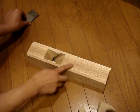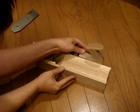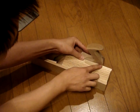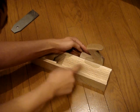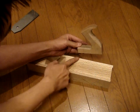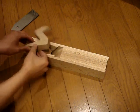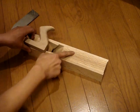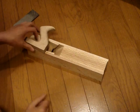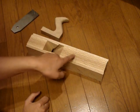So try to keep it in a middle-ish area. When marking out, I placed the iron and my tote and kept moving back and forth until I found a good spot. I marked the back end, scribed a straight line across, measured the length of the tenon, scribed another line across, then measured the width and basically centered a mortise by marking from both sides.